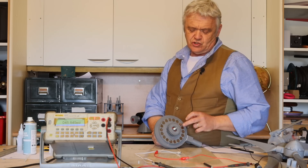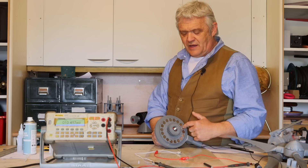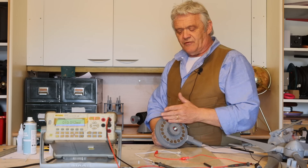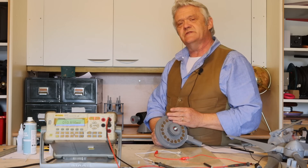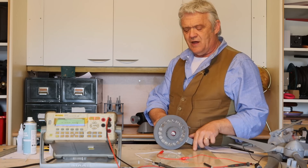I've just chosen north-south, north-south, north-south, but you could make a Halbach array if you wanted. You could also put a steel disc on there to direct the flux path. That's conventional wisdom — I'm not sure I'm completely convinced about it — but it is a fairly adaptable thing.